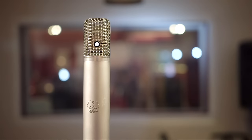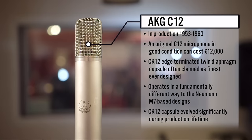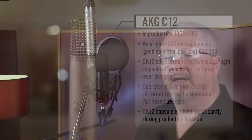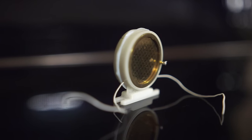In this test we're going to be using the AKG C12. This was a microphone introduced in 1953 and made for a decade, stopping around 1963. During that time almost every aspect of the microphone changed — and subsequently many repaired and serviced models have been changed as well, as we've discovered with this particular example on loan from FX Rental. They changed the diaphragm material, its thickness, the cavity in the back of the body, and the transformer. This particular model has a replacement later-generation capsule with a nylon surround — the early ones had a brass surround — which will likely give it a slightly different sound from the model the Slate system was designed around.